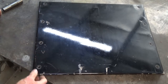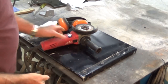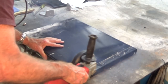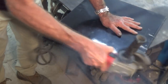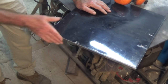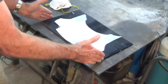I'm going to get rid of these right-angle edges here — we're going to grind those off, get a flat piece of stock, and then we can go ahead and mark this out. It turns out you can cut carbon fibre with an ordinary metal cutoff disc. It does the job really well. I'm just going to slice off these flanges and the holes and get this down to a flat, manageable piece. I've cut that down into a smaller piece which is just slightly bigger than the pattern we're going to cut — this will allow it to fit inside the machine we're going to use for the next step.